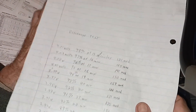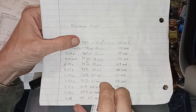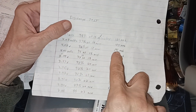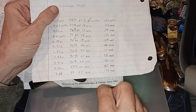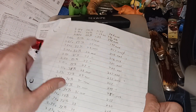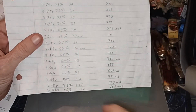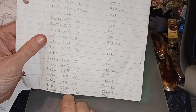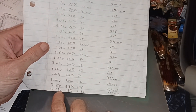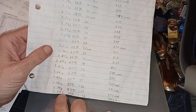I ran the test charging and discharging — both took quite a few hours. It started off at 4.05 volts and I monitored it at 98%, watching it drop about 0.01 volts at a time. It just kept dropping and dropping. After 30 minutes I realized I'd just let it run and wait until it reached the 50% mark rather than watching constantly. When a battery reaches three volts, I wasn't sure if 3.09 volts meant the same as three volts.